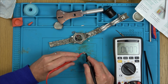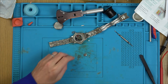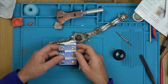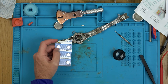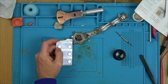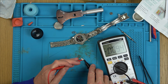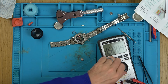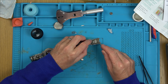No voltage in that battery at all. Let me Google the equivalent battery. I have a Renata 371 — let me put that in because at least then it's a nice good quality one. There's been quite a bit of wear in here — needs a good ultrasonic clean. Looking at this plate, I thought it was to cover up the battery area, but it's actually to cover the coil, and that might be why it's not working — it needs to make good contact.